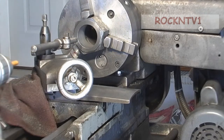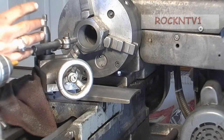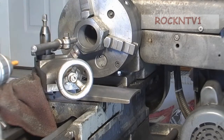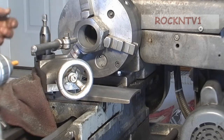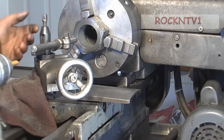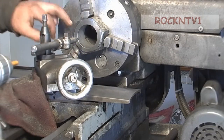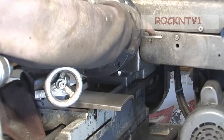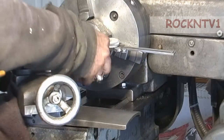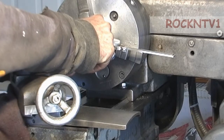But with homeowner tools, when you get below a thousandth and in the neighborhood of half a thousandth, if you're within tenths, you've got to fit your part from there if you want it to be nearing exact. It don't take but a couple of degrees or having your micrometer in your hand too long, and next thing you know you're off by a couple of tenths. I'm going to measure this again - I've got two inches, one hundred and eleven and a half thousandths, or eleven plus a little, not quite twelve.